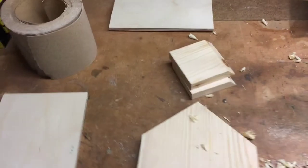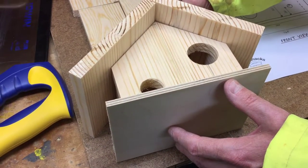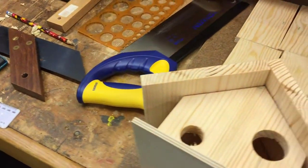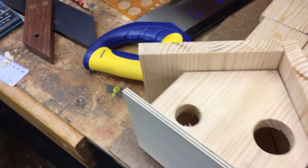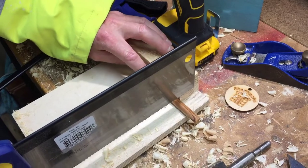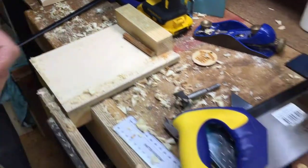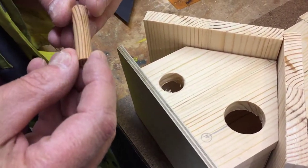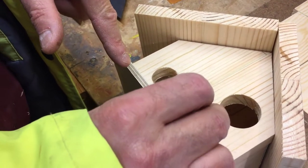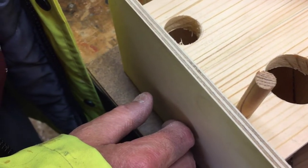Where's my plywood base? Okay Shed Hackers - it's looking like that. And we'll put a hole in there and a piece of dowel in there for the bird to stand on. I can cut that now with a tenon saw. It has to go inside the wood itself. Drill a nine millimeter hole for a ten millimeter dowel - that'll be a nice tight fit. So that will be poking out there - that's a pretty good solution.